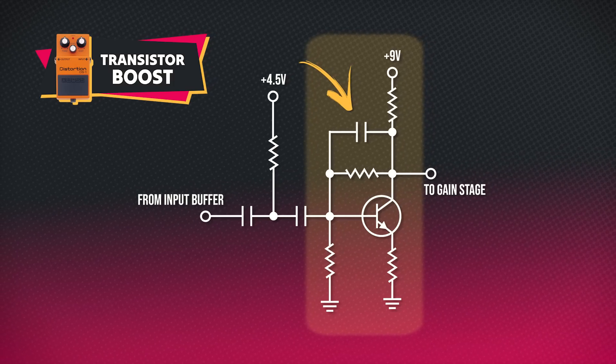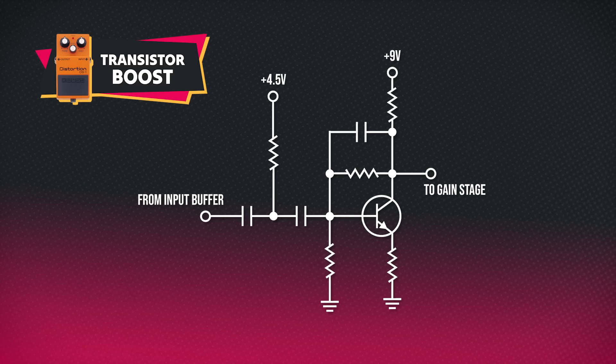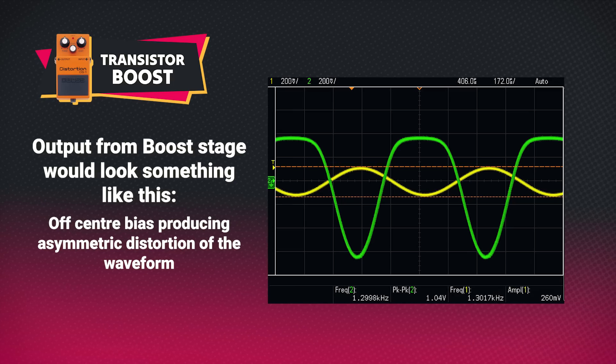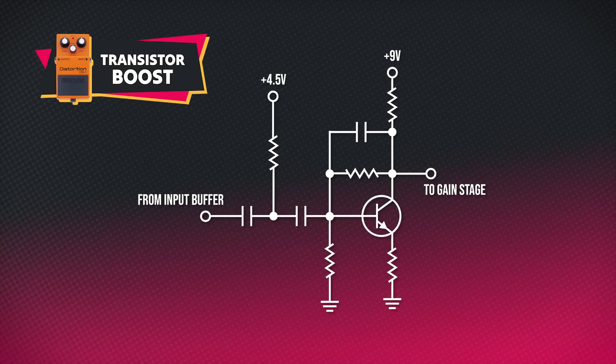The voltage gain of the transistor is set by these two resistors and then refined by the contents of the feedback network. Feedback networks in amplifiers are incredibly important — they essentially reduce the overall gain of the amplifier to provide essential stability, keeping the amplifier from running away into oscillations, reducing the potential for noise, and generally making the amplifier behave more consistently. Despite the negative feedback, there is still a massive amount of gain applied by the transistor, which will push the signal amplitude above the 9V supply limit, clipping the signal in an asymmetric way. This means the signal is already distorting before it even reaches the main op-amp stage of the pedal. No matter what happens next, this transistor boost stage is going to be exerting a considerable amount of influence.